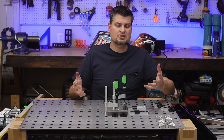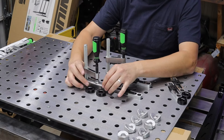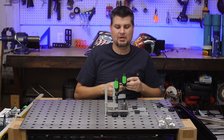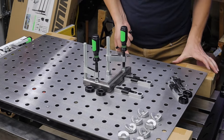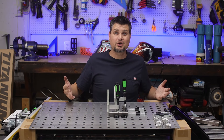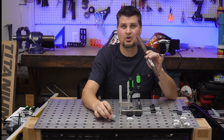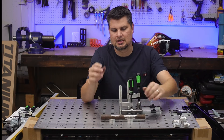The holes are on two-inch spacers, but let's get real — very seldom are things going to line up exactly, so you use your bump stops as your starting point. The other nice thing is they come with these little adapters — bar stop type adapters that go in upside down. They have little magnets, so yes, they thought of that. You use your bar stops and bump stops to make a pretty much perfect frame and fixture, clamp it down nice and tight, and you are ready to tack it up. It also comes with eight V-block type adapters, which makes it easy if you work with pipe or round tubing.